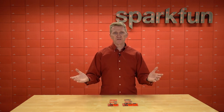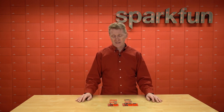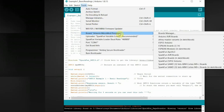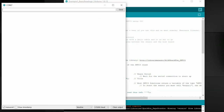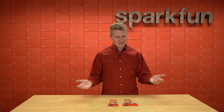Say I want to measure the temperature. I've got my main board and I happen to have an Artemis processor board handy. All I do is pop that into the M.2 connector — and because it's M.2, I can't put it in incorrectly. Then I'll take my environmental sensor board and, just like the processor board, pop that into its M.2 slot. Upload a little bit of code, which I don't even have to write myself because we have examples. Make sure that my board definition is set to SparkFun Artemis MicroMod, upload the code, get results. It's that easy. But maybe you want to know what the temperature is at the other end of your house — if you're using the main board double, pop in the Wi-Fi function board, make a quick code adjustment, and now you know what's going on over there.